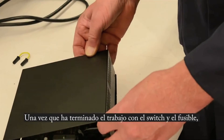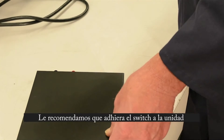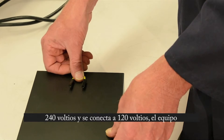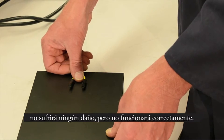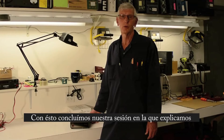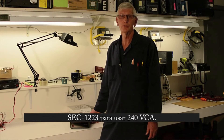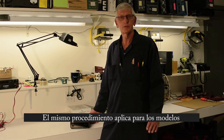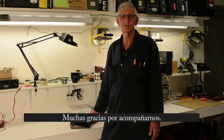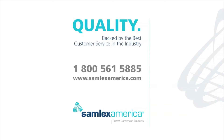Once you've done that, reinstall the cover. I would hang on to the strap and maybe tape it on top so that you know it has been changed. You won't have any problems applying 120 volts to a 240 volt unit, but it will not work 100%. And 50 or 60 hertz really doesn't matter at all — it's a switch mode power supply, so it can handle any frequency. That concludes our session for modifying one of our desktop power supplies, the SEC 1223, for 240 volts. The same applies for the 1212, the 1235, and the 1235M. The strapping is in the same place and looks exactly the same. Thanks very much for joining us. We'll see you next time.